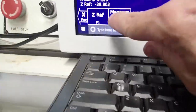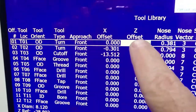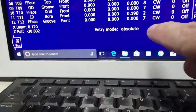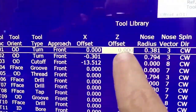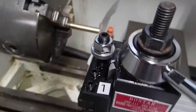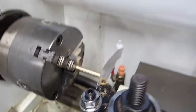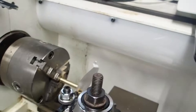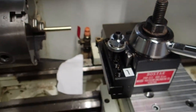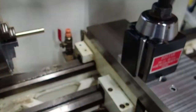Now, if I hit measure tool right now and I'm on tool one for the Z value, let's go ahead and do that, and I hit measure Z, guess what happens? It's a zero, because this tool is touching the reference position and it's the reference tool, so it's not shorter or longer than itself. So I'm going to hit tool check. Tool check. I'm going to put tool 2 in,